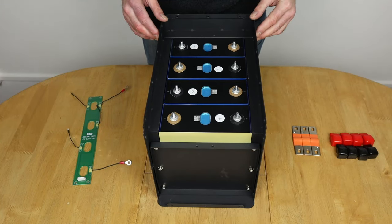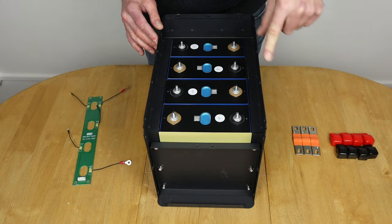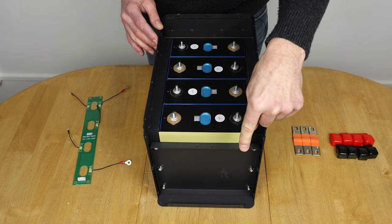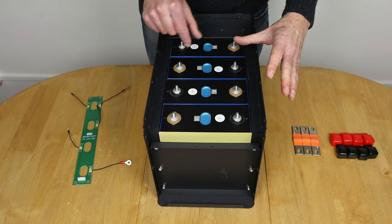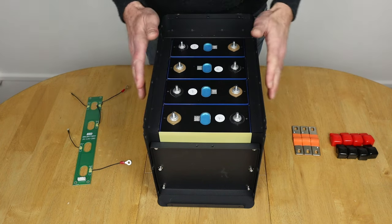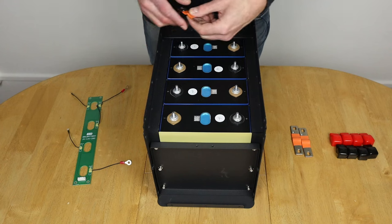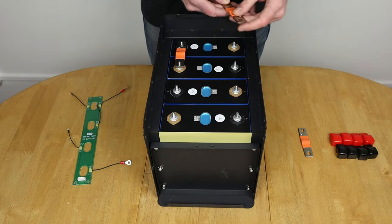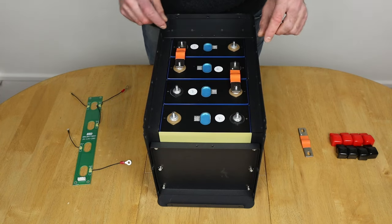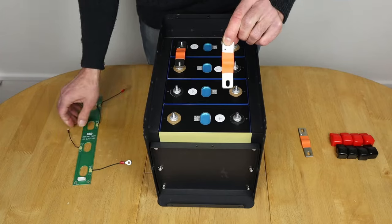Time to connect the cells up to make the 12-volt battery by connecting them in series with bus bars between the positives and negatives. The main negative feeds through the BMS which sits on top, and the wires come to the negative terminal. The main positive goes via a fuse directly to the positive terminal. The bus bars also come with protection covers — red for positive, a lighter beige color for negative — and they're flexible, so they move as the batteries expand and contract during charging.